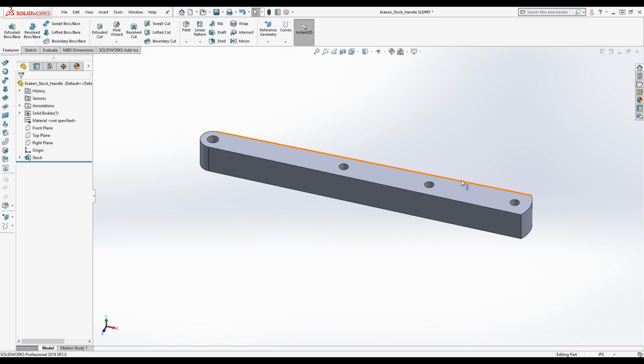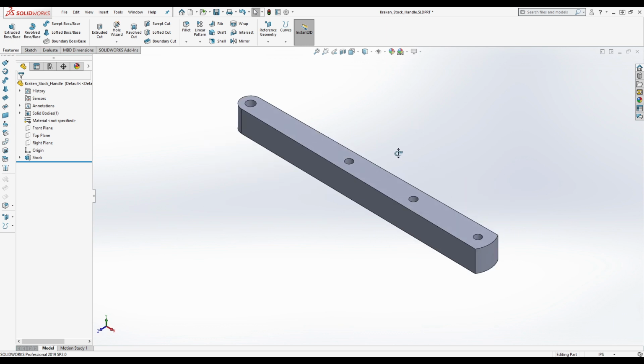This is not something that he would be putting in a fractional measurement for, okay? 0.166 is what we're getting. Again, you're wiggling the calipers a little bit back and forth to make sure they're flat, and then also rocking it to get the lowest measurement, right?